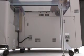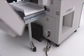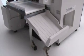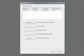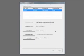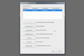The sorter itself is now installed. All that's left is to put the printer PC back in place and get everything cabled up. The last piece is to install the sorter eject tray — it's different than the regular tray and goes on the left-hand side of the sorter unit. After we install the SureLab sorter hardware, we need to enable its use in software using the maintenance utility on a client PC. First, do a pre-operation check to bring SureLab online. Click OK on any prompts that may occur. Click on the maintenance utility screen to ensure it's the active window and press Ctrl-Alt-S. Enter the admin password and click OK.